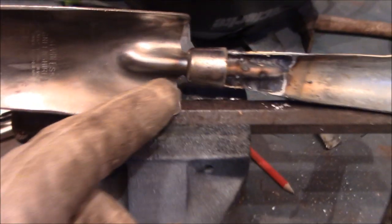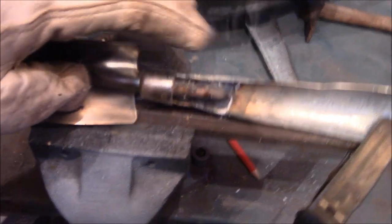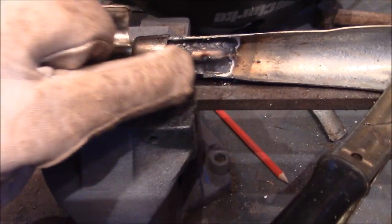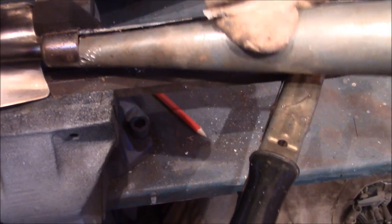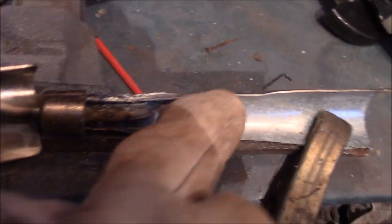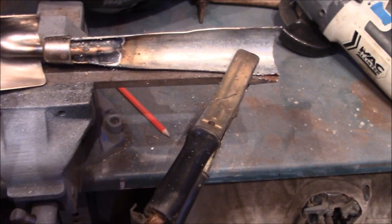It's still a bit hot but you can see the weld around the trowel blade - that's been welded straight into the bottom half of the handle. As you can see at the top there, it's welded nicely all the way around, so I know that's a really solid fix inside there. I need to let that cool down, and then this part here will be fitted down inside. There'll be a little bit of fettling to get it to sit in there, then I can weld up the seams on both sides of the handle. Hopefully this is a handle that won't break.